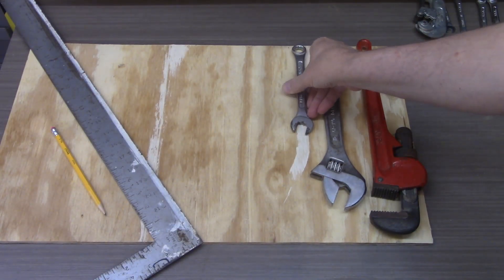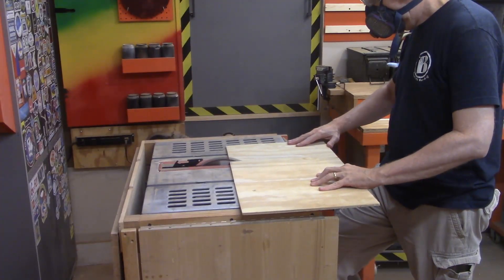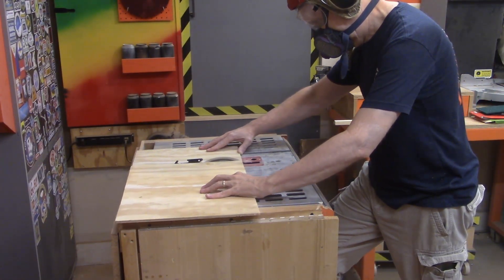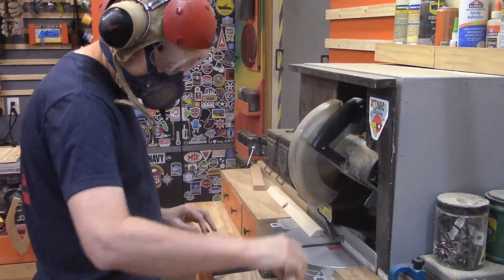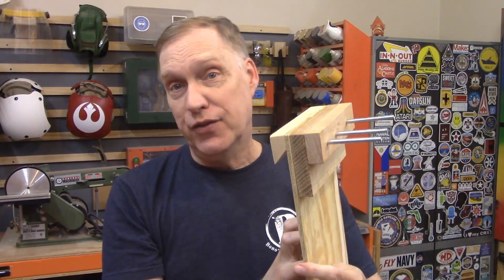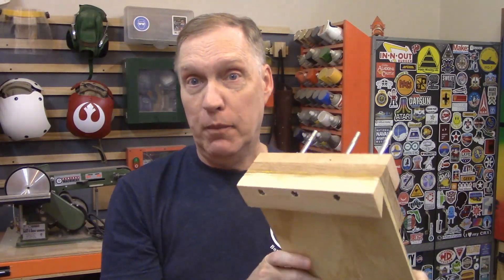The first step to this build is to lay the wrenches down on a piece of scrap plywood to find out how wide it has to be, then mark it off so that I can cut it. Then it's just one quick pass on the table saw to give us our backer board. The chop saw is used to cut the other three pieces of wood, and all three of these pieces are scraps from the lumber bin, meaning they're free. This whole thing is just four pieces of wood: the French cleat on the back, the two pieces of oak up here that hold the bolts in place, and then a piece of plywood. Mine is seven and a quarter inches wide, but if your wrenches are different, cut whatever width you need.